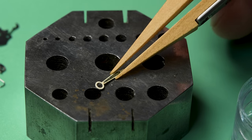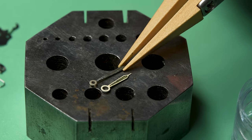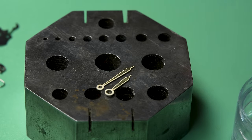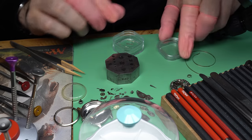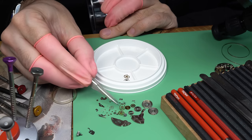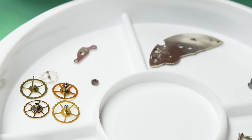Taking a quick look at the hands, you can see how the lume has turned from its original white all the way into this greenish dark brown — it just looks rotten. There are two issues with that. One is aesthetic: it just doesn't look nice and it doesn't match the outside. The other issue is that eventually the lume will fall out and it can work its way into the movement and slow things down. So I think I may want to address that with this one. I like to try to keep stuff more original than not, but I might do it in this case.